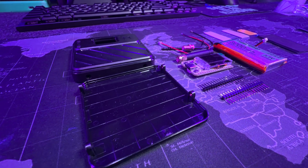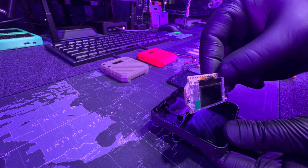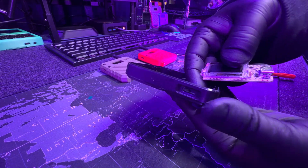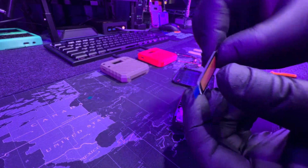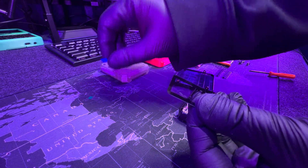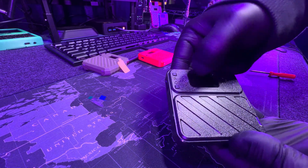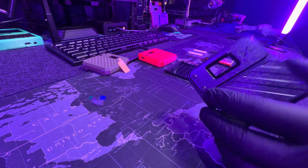During this demonstration, you're going to see me try to put the Heltec V3 in first — I don't recommend doing that. I was just trying to feel how the layout was going to be. You should definitely put in the antenna first; it's just going to make the whole project easier if you start with the hardest thing first. There's also a little plastic glass cover that you put on to help protect the Heltec V3 on the case. It's sticky, and you're going to stick it onto the front — make sure you have it the right way. Once you do that, it should look just like this and will protect the screen of the Heltec V3.